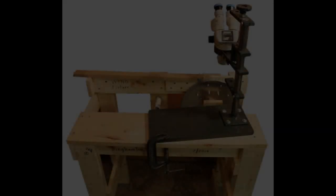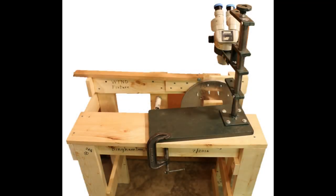To be able to build a new band and chain that actually works, what we had to do is build a new band of the wires. This is a fixture that was built to be able to wind the 3/1000th diameter wire onto a mandrel that would be the right length when you get through. So the critical part of this fixture is the diameter of the mandrel to be able to produce the right length band.